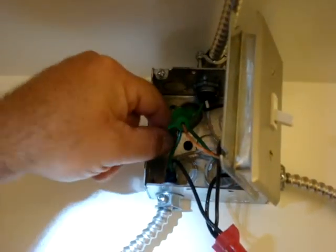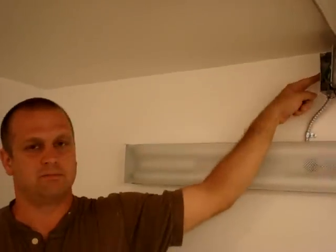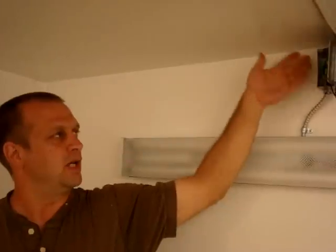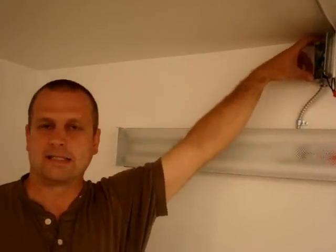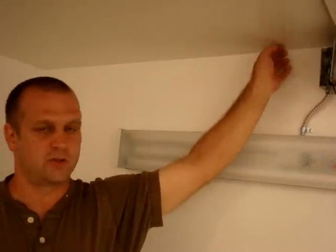It's extremely important to make sure that you've got that wire running back and secured properly to the box. That's probably the biggest mistake I see with these metal boxes — people will simply wire the metal box in as if it was a plastic box and never ground the box. And if a hot wire fell against this and you touched it, you would get 120 volts into your body because there's nowhere else for the electricity to go. It would never trip the breaker — you'd have a completely dangerous situation. You'd wind up electrifying the box because the box conducts. When you see those blue, black, or gray plastic boxes, those don't need to be grounded. But in a commercial application like this, where you've got a metal box for impact resistance that's surface mounted, it's extremely important to ground it.